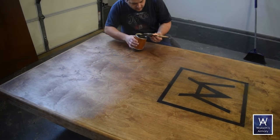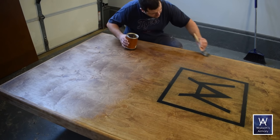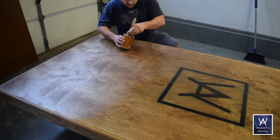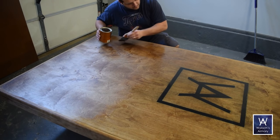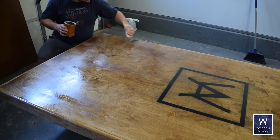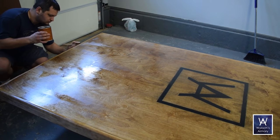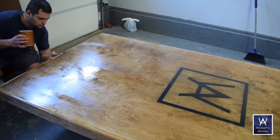Next day I started going with the polyurethane — this is quick drying oil based semi gloss. I did three or four coats of that, sanding with 220 grit in between each one. When that black spray paint dried, there were microscopic black dried paint particles sort of sitting on top. So when I started applying the stain, it grabbed those and just mixed a little bit. Around the area of the logo you can see it's a little bit darker — it kind of looks like it was burned in a little bit. So I got a bit lucky there.